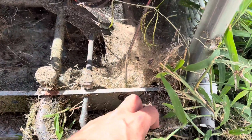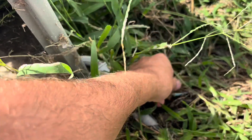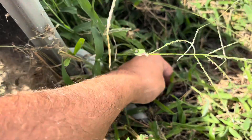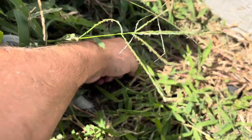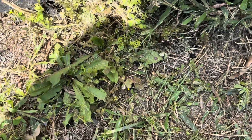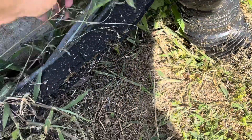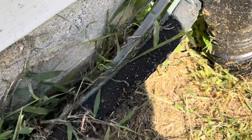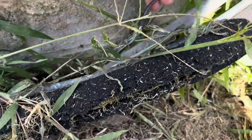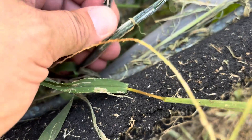Let's just make sure we don't have any wires rubbing here — and actually we do. We've got a little bit of bare wire showing here. I'm surprised they don't beat this up more with the weed eater. See that wire right there — that could be a problem too. I might have to run a new thermostat wire here. See, that's bare, that's bare wire there.